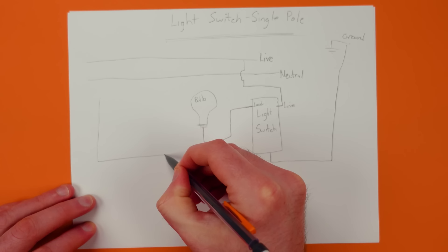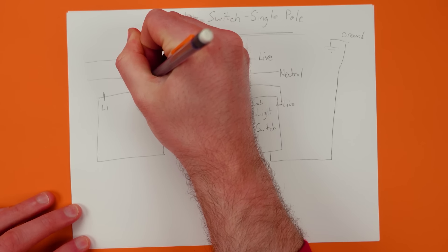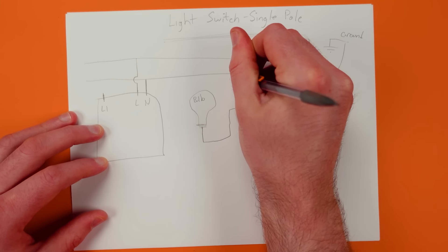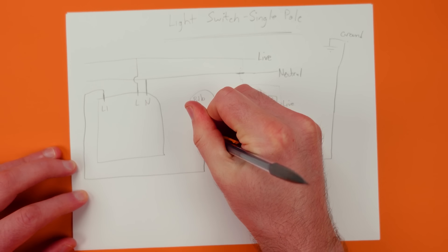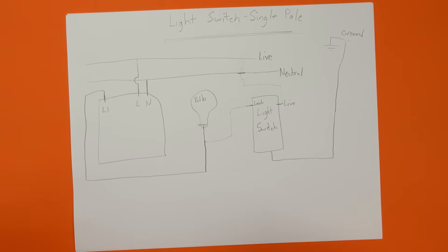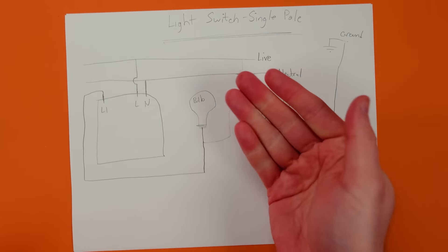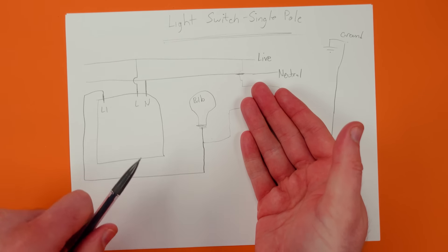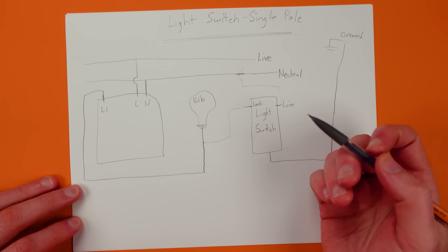Most people are probably going to try to use a relay to make their light switches smart. One of the great things about relays is that you can usually still use your physical light switch after you've wired this in. With a module like this, you can actually wire in two different light switches at the same time. Your standard single pole light switch has live going into one side of the switch, then out to the load — to the bulb or fan. This looks very similar to our standard loads diagram. When we add in the relay, we're going into the neutral of the relay and the live, removing connections to the light switch and to the bulbs. If you didn't want to use the switch at all, you'd just remove it and use all your automated controls on the relay.